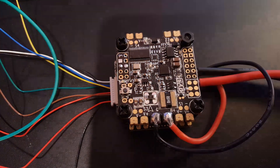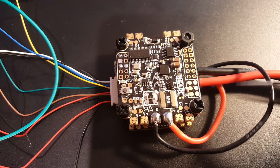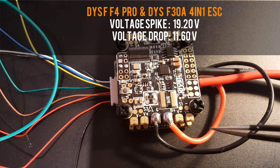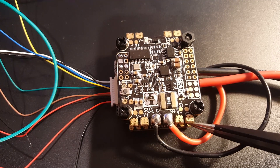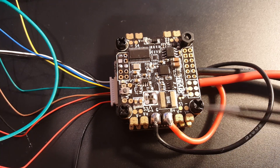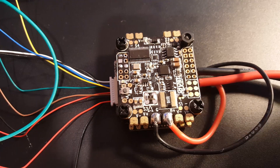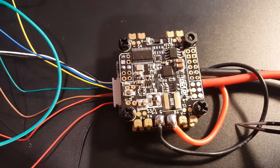From the test results — I ran it about 10 times and it was consistent each time. The voltage spike measured 19.2 volts, which I'll show on screen. The voltage drop was 11.6 volts, which is good — but possibly not good. Whether that's acceptable depends on whether all those capacitors were active for just one motor or shared across all four. The motor used was the Emax 2205S 2300KV.